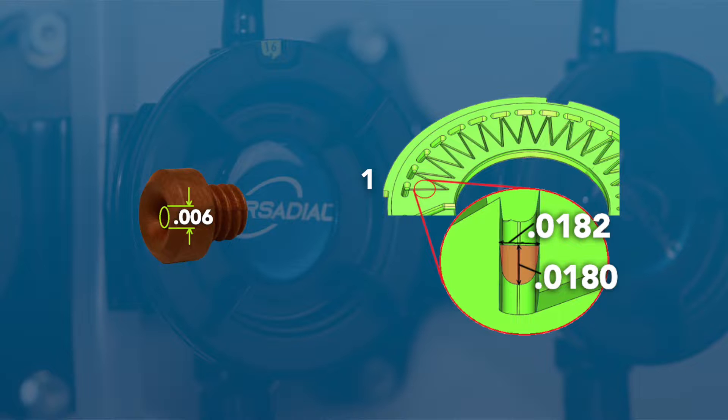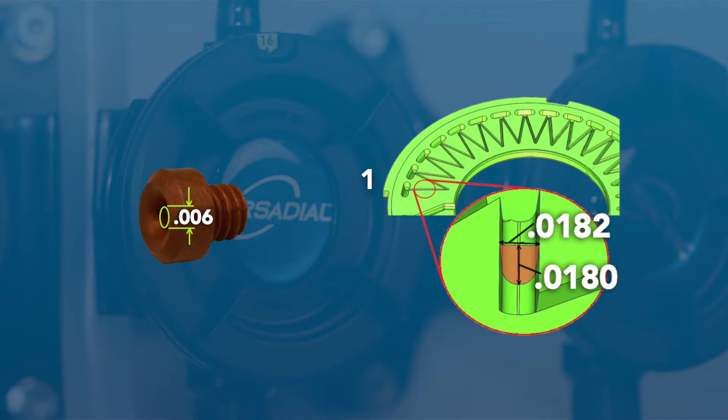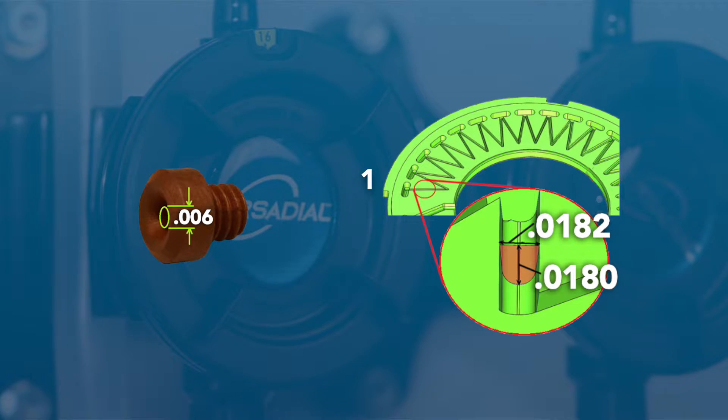The width of this channel is three times larger than the orifice of the copper tip. The pre-filter is designed to capture any particulate that is large enough to clog the dial. If it is small enough to pass through the filter, it will flow through the dial and out the injector.